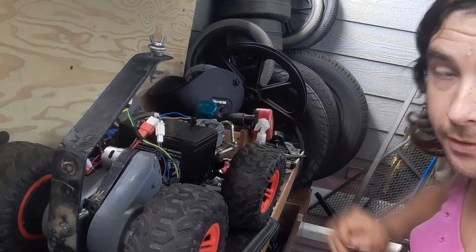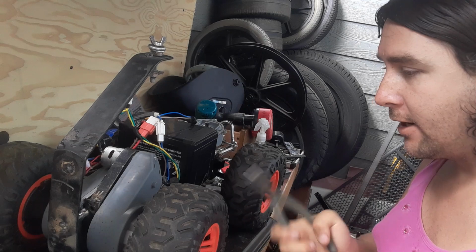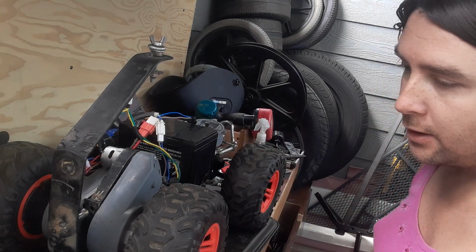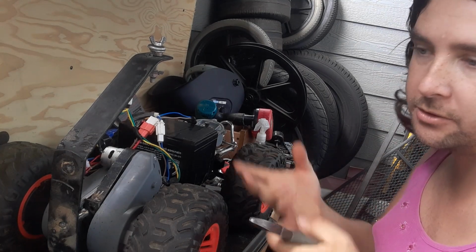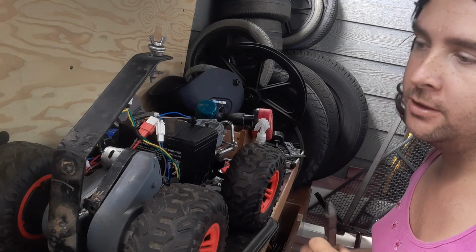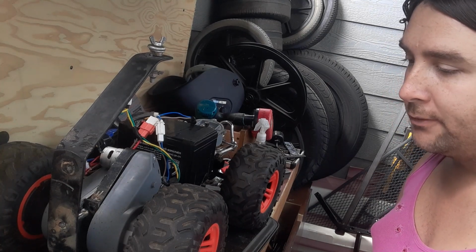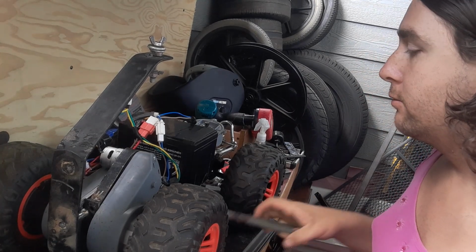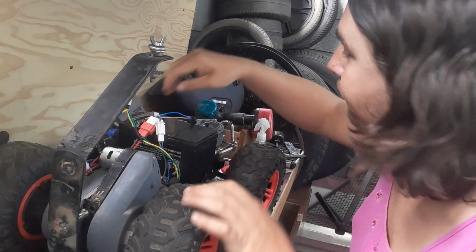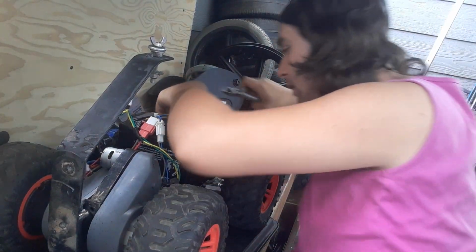It turned out what was wrong with that controller was the relay, the wireless control unit relay. The electromagnet in it was still working, but it must have been soot built up or something, from over-amping it, and it just wasn't making a connection to put the power out to the things. And then while tinkering with it trying to bypass that, I wound up blowing a MOSFET anyways. So yeah, it's definitely no good now, but I don't really care. I plan on replacing it with one similar, just rated for higher voltage, so less likely to break on me.